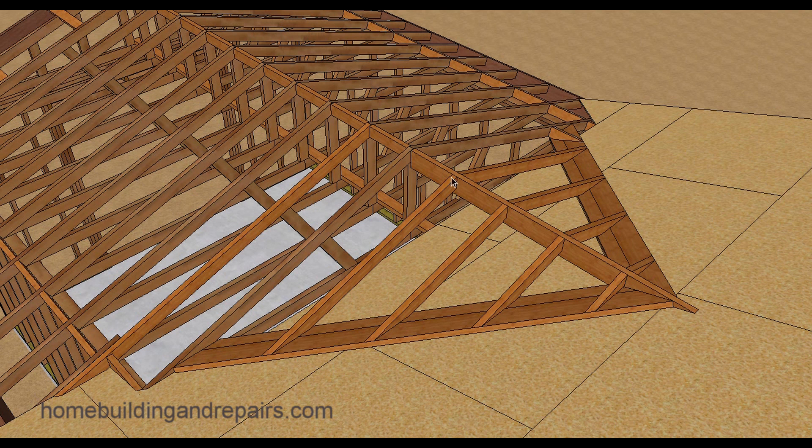If you have a 16-foot span where you might only have a seven-foot rafter, a two by four might work. Two by six is fine, but if you have a span of 30 feet you might need two by eight rafters and a two by ten ridge. Keep that in mind — what I've shown here uses two by six, and maybe that's not going to work for you. I'd say any rafter smaller than four feet can be two by four. I like to use two by six for anything six foot and above. If I have a six-foot board and it's going to be composition shingles, I might make it a two by four.